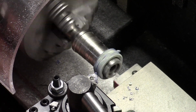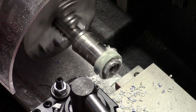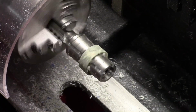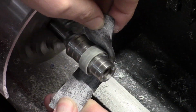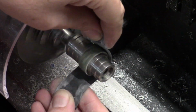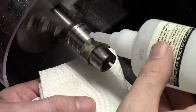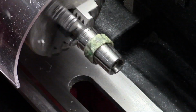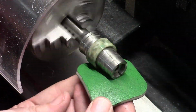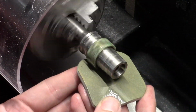With the inside of the ring finished, I switch to a mandrel to hold the ring and start taking care of the outside of the ring, smoothing it down, making sure it's all nice and clean. Once it's cleaned up, I go ahead and switch to sandpaper manually again and work from about 120 to 1200 grit. I add 4 to 5 coats of CA glue, using heat if necessary, until that's completely dry. And then switch to the micro mesh again. This time I use from 1500 to 12,000 grit to give it a nice gloss polish.